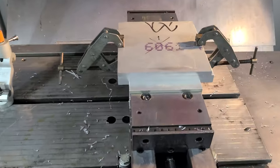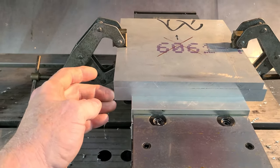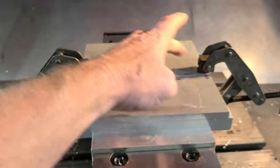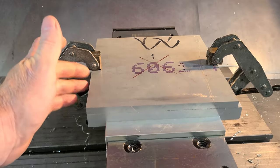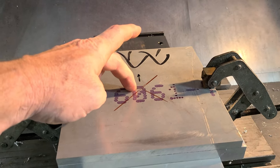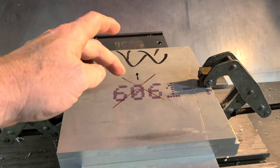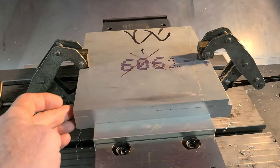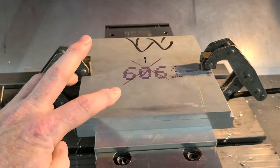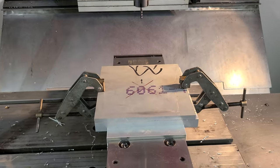Here's the setup we got. Just a great big thick three quarter inch piece of aluminum. I drilled and tapped holes so that when we uncover them, we can actually bolt this thing down and then cut the outside off. For right now, we're holding it with these clamps. I use just a simple X method — middle of the part, center of everything. Just line it up kind of close to the edges and clamp her down. We should be able to repeat this. I have three of these things to make. Let's go ahead and send it and see what we get.